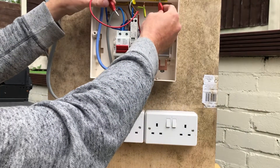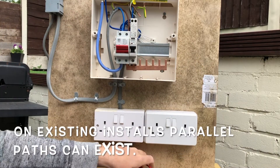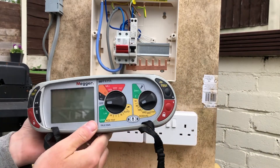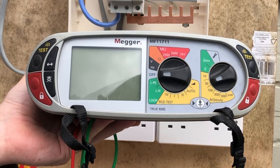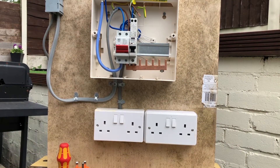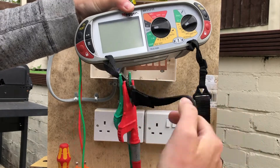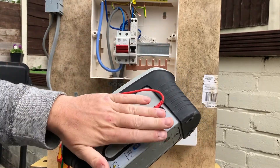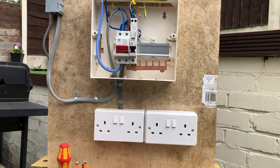Traditionally you can put a link from the busbar at the top into the top of the live, but I don't like doing that because if you've got any parallel path it'll still show earth continuity all the way through. Today we're using the Megger 1711 tester set on continuity — the orange indicator. Leads are plugged in at the back. Red is the live, green is the earth, and today we're using the crocodile clips. A handy tip: when you're not using them, put them on your strap — keeps them out of the way, stops them tangling up. Make sure the leads are steady, and keep checking they don't pull out.